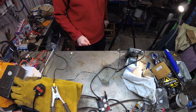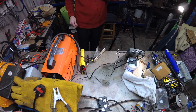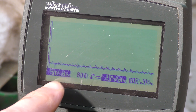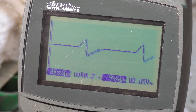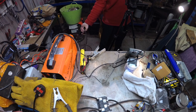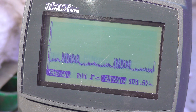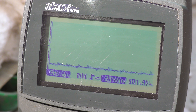Out of pure curiosity, we'll now do the inverter welder. There it is — a DC line. You can see the AC is making a difference; it's got little ripples. Let's spark up and see what it looks like. Oh, you can see the current pulsing — wow, that's quite interesting! So obviously it just switches on and off really rapidly to get you the current that you want.